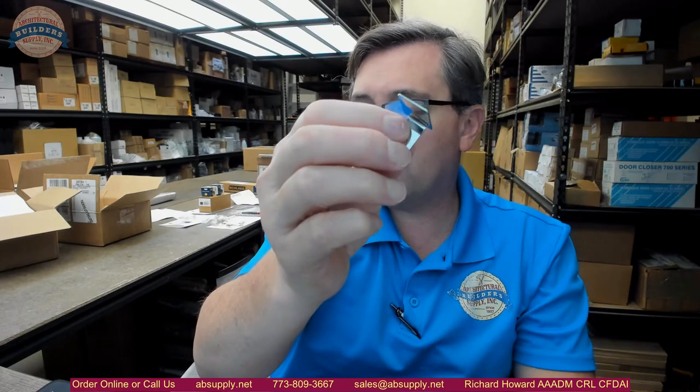Caps are for 3/8 or half inch deep U-channel and 3/8 dry glazed channel. A couple of basic dimensional properties: this video is really just here is what it looks like, here are the sizes — about 7/8 by 11/16 by about 3/4 by about 7/16.